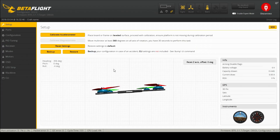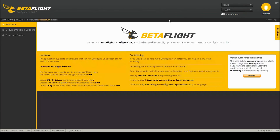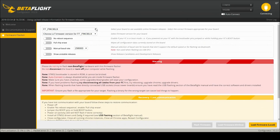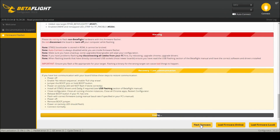I just noticed this is running Betaflight 3.1.7. So I'm going to the CLI to double check — it's an Omnibus F4SD running 3.1.7. 3.1.7 was great a year ago, but I'm not going to fly it now. So we're going the full thing on this. This is an Omnibus F4SD, and 3.3 is out now — why not? Download, flash firmware. It took me two tries; I just rebooted it and it seems fine. This is one reason I leave the sticker on the buzzer until I'm ready to fly, because it's a little loud now but not crazy.